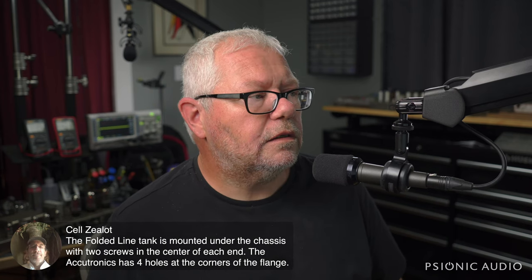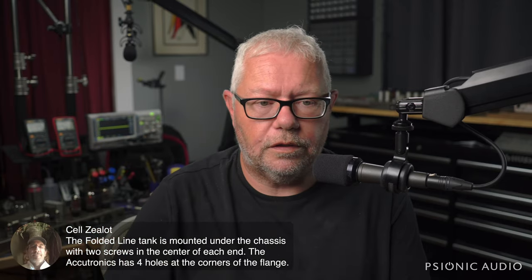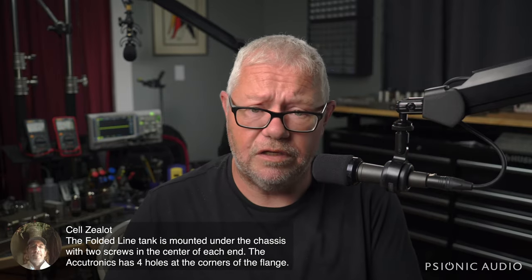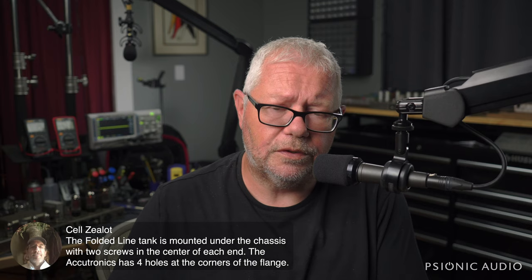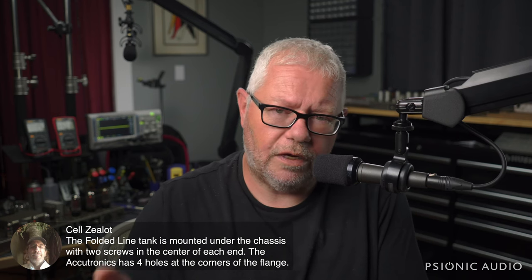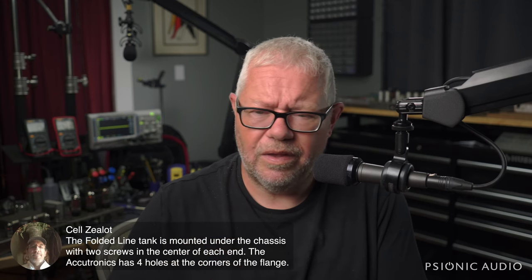The last times people have brought me JC120s and JC77s and such, I've declined them. I don't think that they're a good use of people's money these days. I think they were a phenomenal, ground-changing thing in 1978, and have gotten cheaper and more poorly built since then. But it's a loud, clean amp with no headroom, with a kind of interesting chorus sound that you can't really adjust, a kind of not great reverb, and a really bad overdrive. And if you play it too loud, even on clean, it's going to break up.